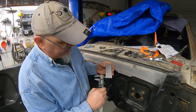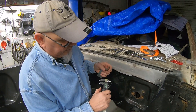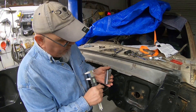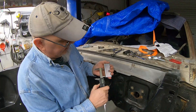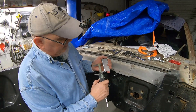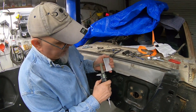I'm in metric right now, and that's what I'm used to working in. I'm going to zero the calipers. When I measure here outside to outside, it basically subtracts the radius of both sides of the hole. So now we're basically 43 millimeters — 42.97 millimeters.